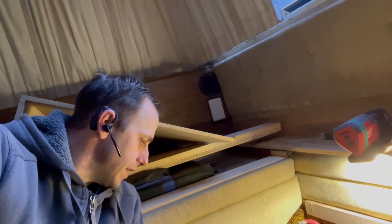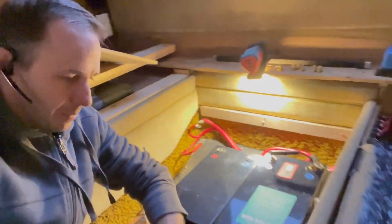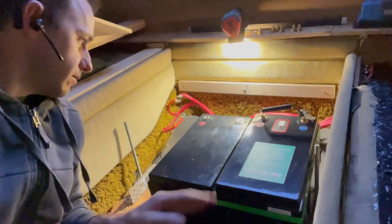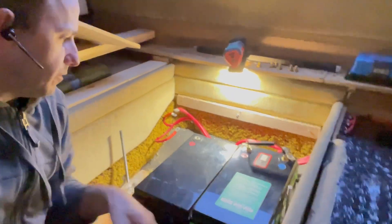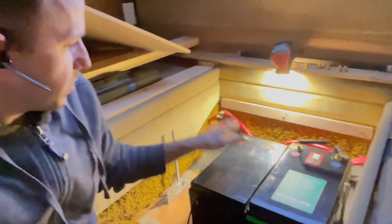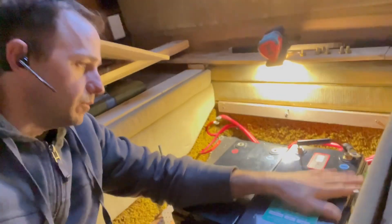For those of you thinking that 450 amp hours of lithium is obviously going to take up more space - not the case. The cases used here are identical; the difference between them is a slight height difference, maybe 15 to 20 mil tops. These are the ones we're putting in - the old 150 amp hour Solkings. When we originally did this we had three of these, so three 150s equals 450. It's a big custom-built American motorhome - beautiful.